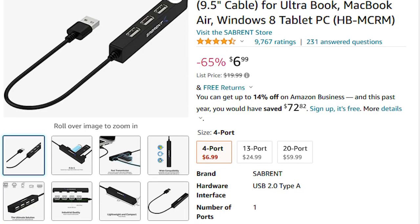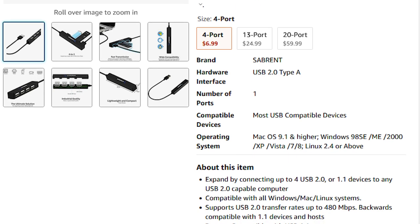One quick note: if you're trying to use multiple different dongles — like a USB LTE dongle and a GPS dongle, or the 5GHz dongle and the GPS dongle — you're going to want to use a USB hub. I have a couple of different options linked down below, but the Sabrent 4-port 2.0 hub is likely more than adequate, as the Pineapple Mark 7 has a 2.0 port. It's cheap, simple, and will just work.